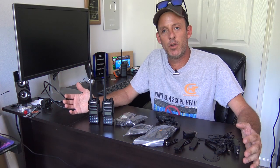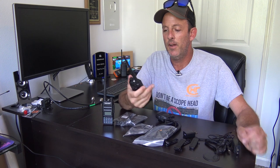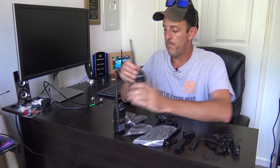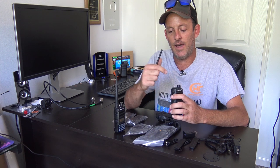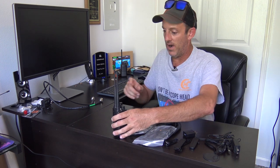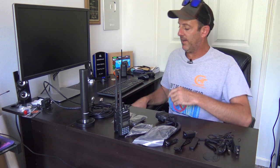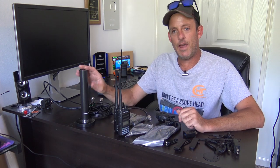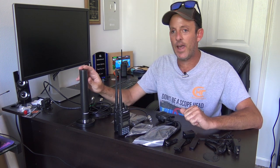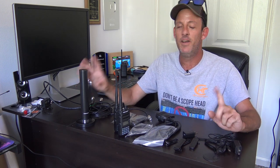Overall, these radios are built very solid — when you squeeze them they don't creak. The antenna comes off with a little Allen screw and it is SMA female on top. So you want an SMA male antenna. For increased range on the three watts you have, something like the Compact Tenna Scan 3 with the appropriate adapter covers amateur ham and GMRS at very low SWR, as well as 800/900 MHz. We had Dr. Jack on the podcast — check those out.